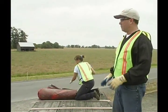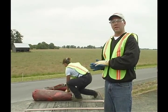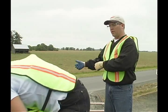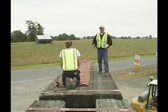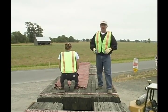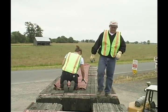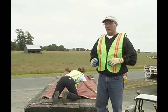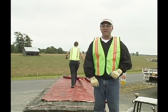Now that we're on top of the load, position the tarp so that the edge is even with the back of the load. Take your bungees off, keeping them for use later. Grab hold of the tail and walk it forward, watching where you're stepping. Once the tarp is unrolled, make sure it's centered and then unfold it. While unfolding, be aware of open spots in the load so you don't post-hole. As you approach the edges of the load, it's very important not to stand up and lose your balance — go down to all fours when working near the edge.